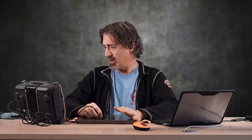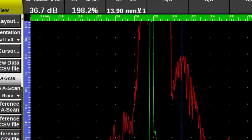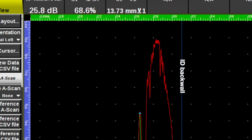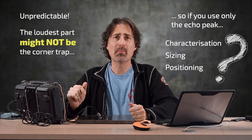Let's pretend that this was a 60-degree probe. The A-scan at 60 degrees only looks like this, and the first thing we notice is that it is all over the place — it's really hard to peak this signal. We'll just auto-80 that and bring that signal back down again. You can see it sort of peaks way off of the back wall, so this might fool us — this might convince us that it's not root connected, but the fact of the matter is it is root connected. Flaws are just weird that way. This one in particular is a realistic weld flaw, so it's got facets, and what happens is that all those little facets are at slightly different angles. Although we expect the biggest hit from the corner trap, that's not always the case — sometimes some of those facets are tilted away from us, sometimes tilted towards us, and we might get them better on the second leg.